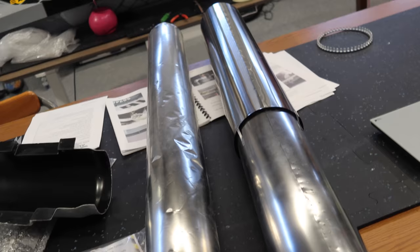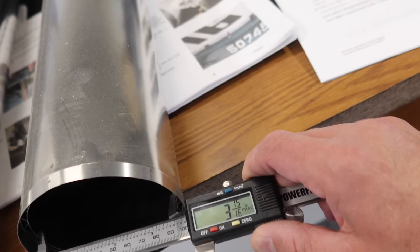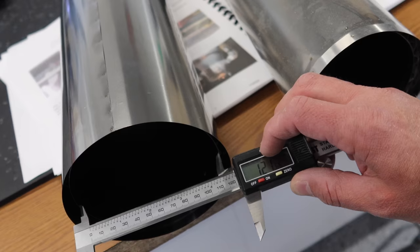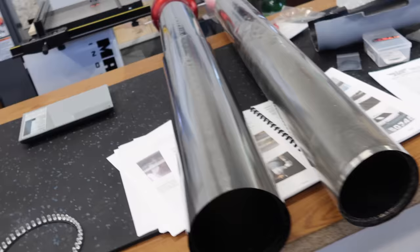You really do need a big pipe. Let's measure the output diameters — the internal measurement. Stock pipe is three and 15/16ths, which I think is four inches — 100 millimeters for the stock pipe. The aftermarket pipe is 121 millimeters. So you're basically five inches on the aftermarket pipe. That is a huge difference. And there's a shot from this perspective as well, so obviously we've got to make some pretty significant changes to our tail cone piece here.